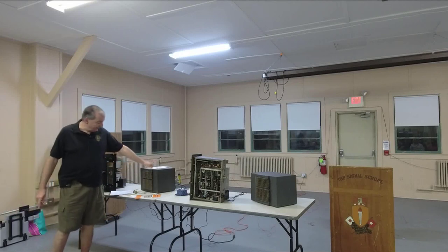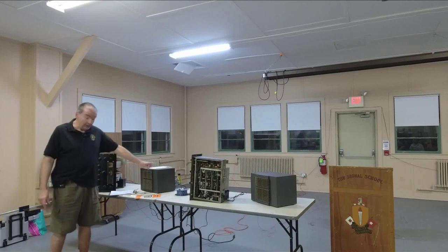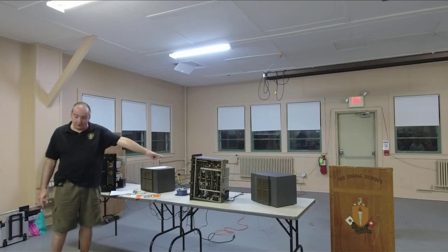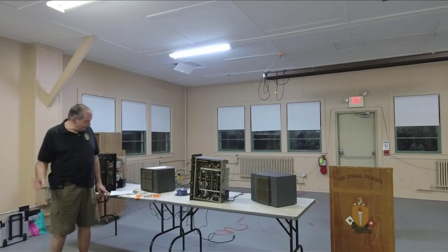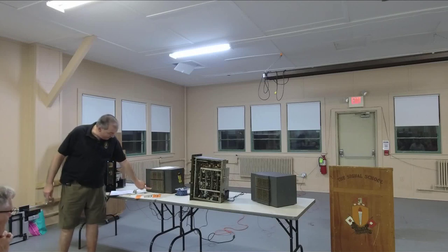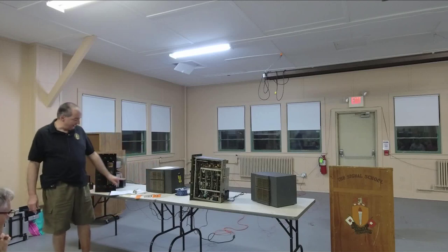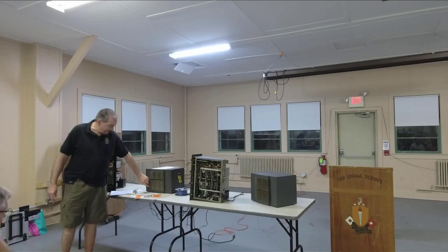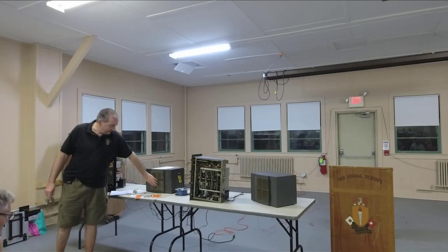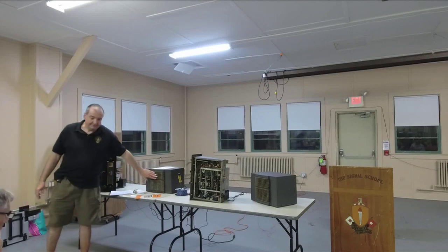This one had the output transformer robbed out with the matching transformer, actually. So it's low impedance only, and it's hooked up to the low impedance output of this. That one has a transformer, so it's hooked up to the high impedance output. Sometimes they had a pre-chrome H here for Hallicrafters. These were probably made for the military. They don't have the fancy chrome H. These fins matched the size on the SX-23, 24, and 25.